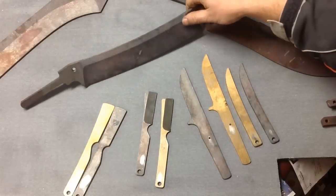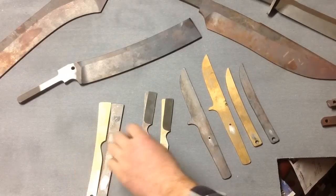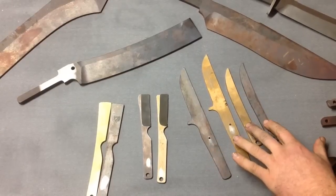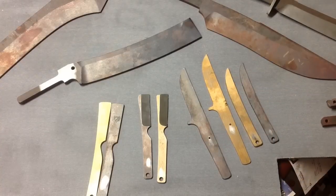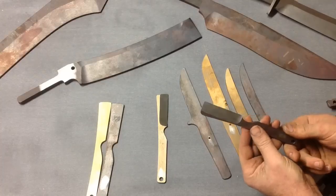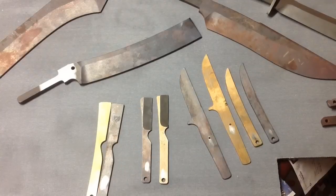When I make one of these choppers I end up with different chunks of steel — what we call drops. I've got some pieces set up here, made to identical thickness, and I'm going to go back and grind them. These are heat treated but done with different heat treat protocols: some are finished out at a Rockwell of 64, and some at a Rockwell of 62. I'm taking these down to a hollow-ground zero edge, and we're going to sharpen them like straight razors to see how they feel, when they fail, and what type of edge properties we get. That will give me an idea if I want to alter the heat treat for a chopper or for specific knives and their purpose.